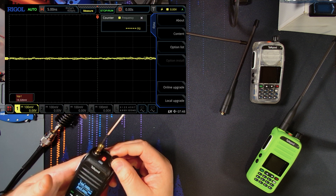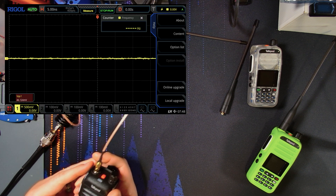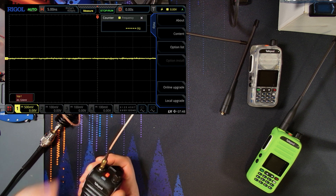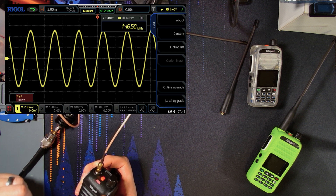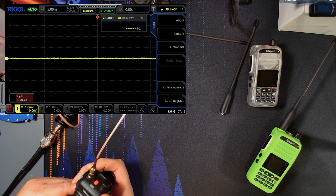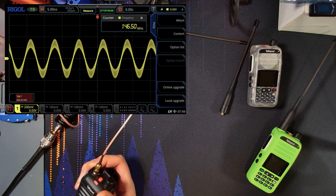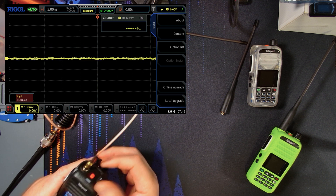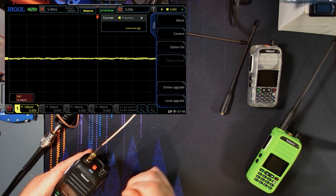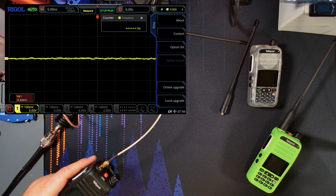This being the most recent radio I received — on high power it looks relatively clean. Here's medium power — once again a nice-looking waveform. And here on low power, we have the same phenomenon going on. I'm thinking they've done a great job at removing the harmonics from this radio, but it feels like they've introduced something else on the low power output.